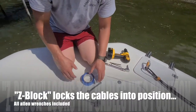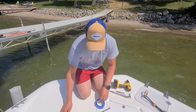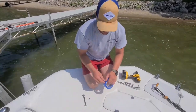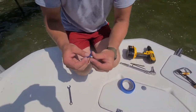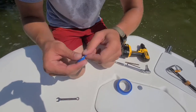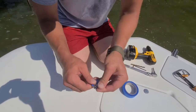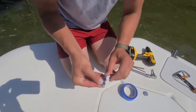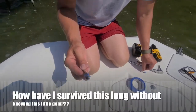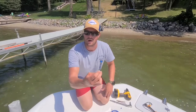Some people might find it hard to get into some really tight or hard-to-reach spots — a blind hole where you can't see what you're trying to get to. A way I was taught many years ago in a shop on how to make a nut fit into your wrench a little bit easier so you can hold it without having to hold it with your finger: use tape, or even a shop towel or paper towel will work fine. Press it and put your tape over the back of the nut — on this one would be the nylock side. Put your nut in like this and push it down into your wrench, then peel off the excess. Now you have a nut that will not fall out, so you can reach way up into a spot you can't touch, get it positioned right, get your bolt started, and then have someone else tighten it from the outside.